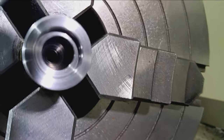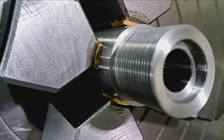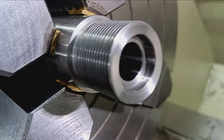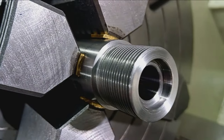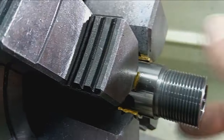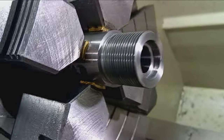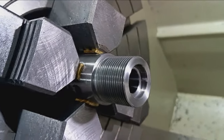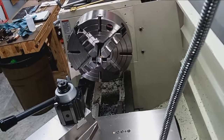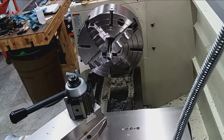So you can see the reflection pretty good. Now there's still some oils and anti-seize and other strange substances on this, but it gives you an idea. Anyway, there's a completed breech. This is a Bartlein M24 contour, 1/8 twist, chambered in 6.5x284 Norma, for a Defiance Deviant action.